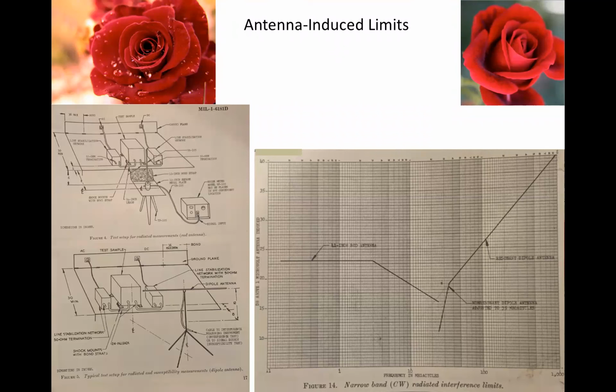The term antenna factor in those days had a different meaning than today. It accounted for any impedance matching and/or balun losses between the antenna element or elements and the actual 50-ohm coaxial antenna terminal. It was simply a loss factor with units of dB. Antenna-induced limits made a lot of sense when the antenna was parked 12 inches from the test sample. It's fairly obvious that this is not a field intensity measurement, but borders on a crosstalk measurement, with capacitive and inductive coupling playing a role.